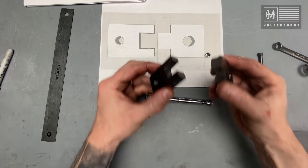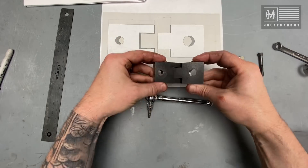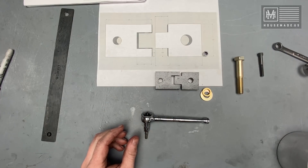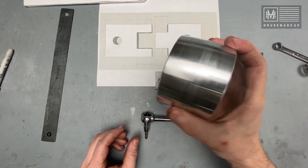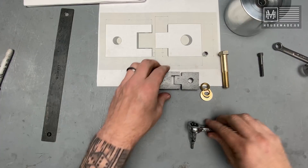Now we've got our hole drilled for the mounting bolt for the wheel, and we've also drilled the three-eighths inch hole in the top for mounting it on the grinder. We've got everything machined out the way we want it. Let's quickly assemble it and see if it will track. I've got all my little pieces and parts here — my bolt and my four-inch tracking wheel, which is a little bit crowned. Let's give it a shot.